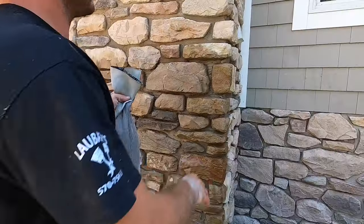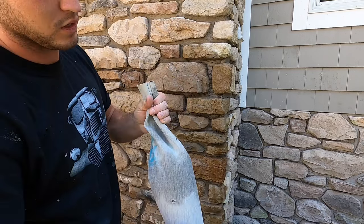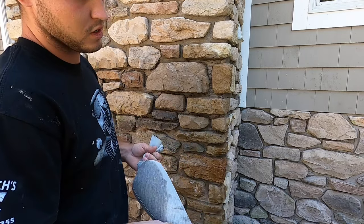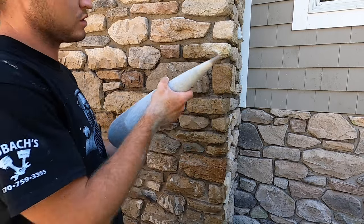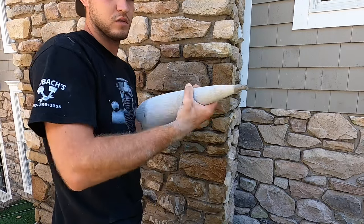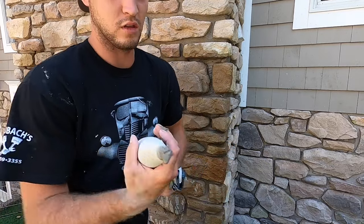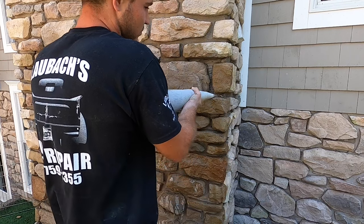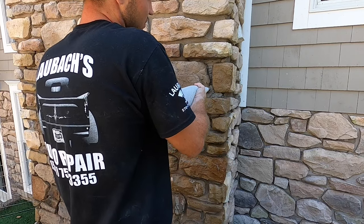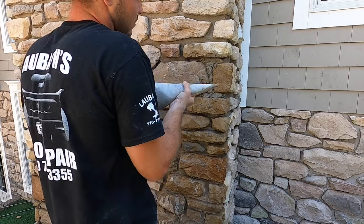So I'm filling in right here. You got your grout bag — I start at the top and I twist it until it's nice and snug, then put it in the joints. All you do is twist it with both hands — this kind of motion — twist and squeeze at the same time. It controls the flow. You just keep adjusting the twist and squeezing and fill your joints.